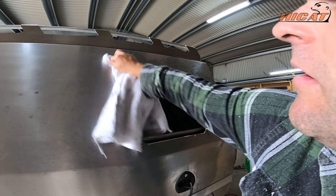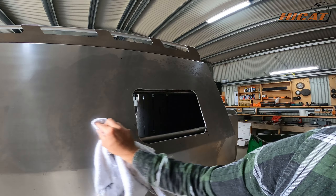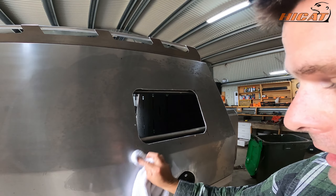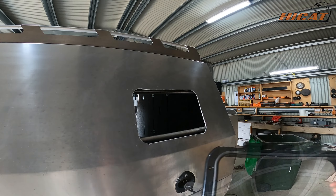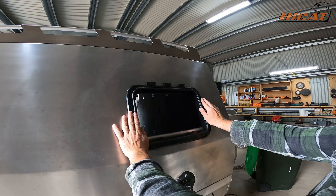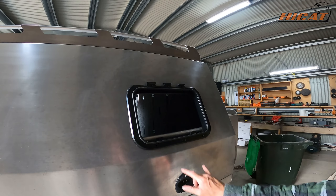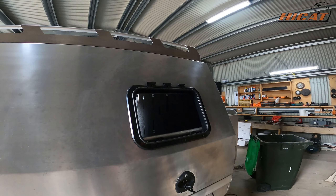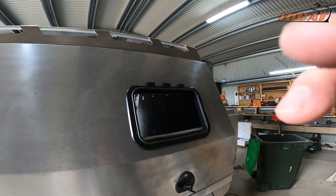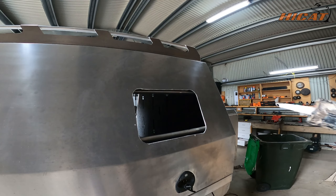Get some rubbing alcohol, rub off all the oils, pencil marks, and pen marks, and get all the cutting oil off — anything that's going to stop the Sikaflex sticking. Now I'm going to mount with the lift-off hinges. I'll just put some tech screws in today because I don't have good bolts — I'll have to get some bolts later. We'll Sikaflex it on, tech screw it back, and then swap the bolts out another day.